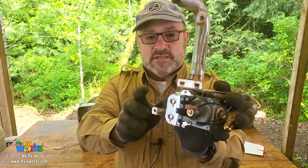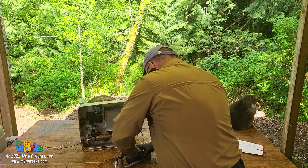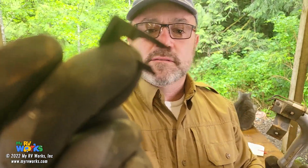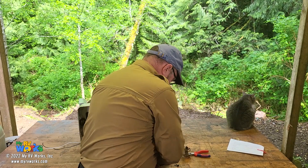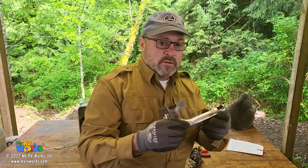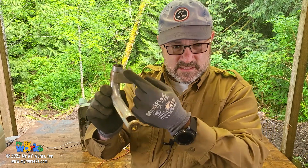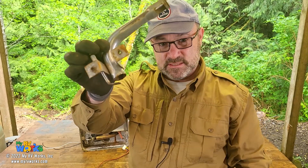On your Suburbans, you'll notice there's this little pin — this little clip right here that I'm going to pull out. That clip is what holds those two pieces together and sits on that little profile there. Once you've got your J-tube or burner tube out, I like to take a can of office compressed air and blow through it, because you may have a spider web or a nest inside the J-tube. So let's make sure that this is nice and clean.